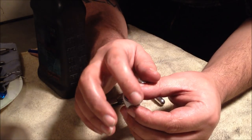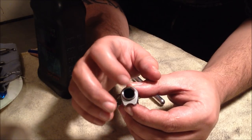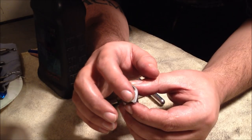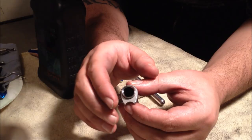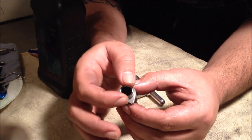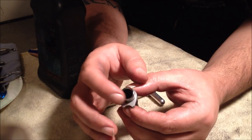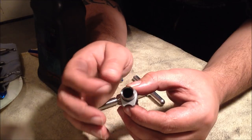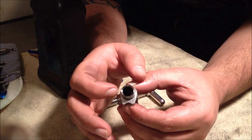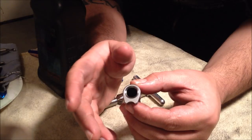But you can also keep it as is right now. It still looks pretty nice. And you get a little bit of a stand-up edge to the edge of the barrel, because once you cut a 45 degree all the way to the edge of the barrel, where there's no hardness to the edge, if you do have it exposed and nick it, it will nick. Once again, you're not going to nick your rifling, but you'll have a nice big gouge somewhere where it'll be there forever. There ain't much you can do to it after that. So it's a happy medium between the two.